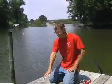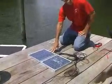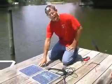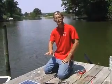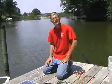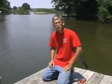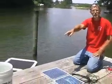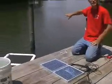We're taking these two solar photovoltaic panels, each one rated around 10 watts. Right now we have noonday sun almost straight up, that's why we have the panels flat. What we're going to try to do is see whether the output of these panels is feasible to run a pump to create circulation for my oyster floats. If the flow is significant, I will build a manifold system that will take the bilge pump and use the output of these solar panels — all floating out there.